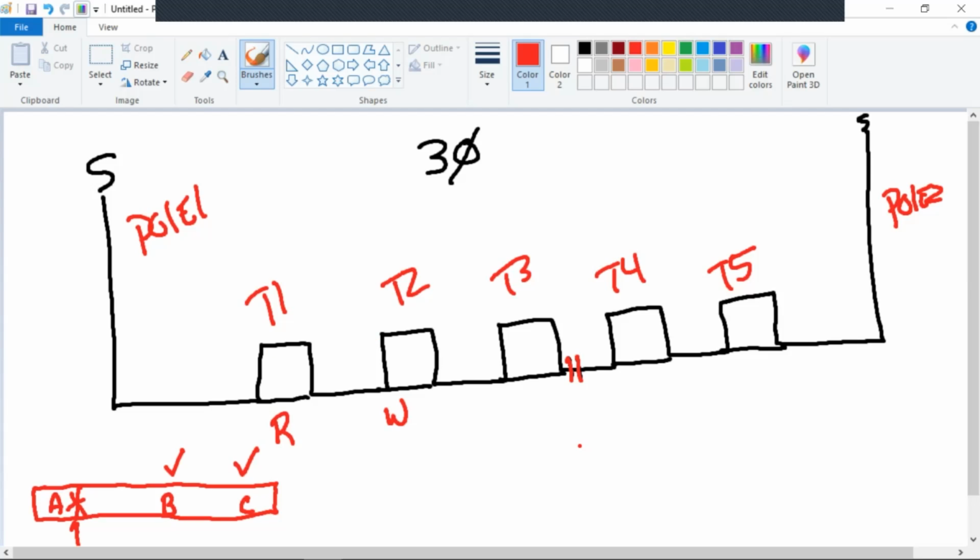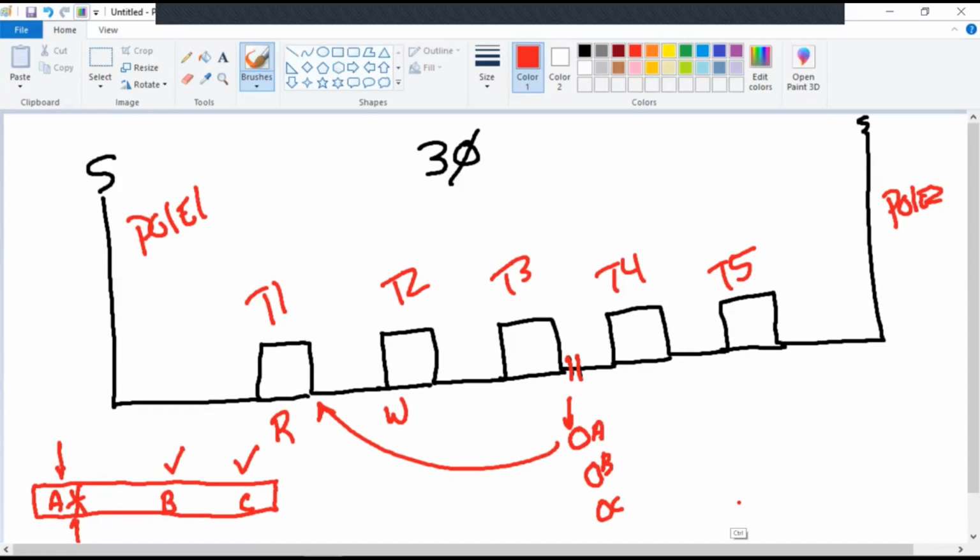Now, were you guys paying attention as far as fault indicators were concerned? If I have a single phase fault indicator, how many wires do I install it on? Single phase. One. If I have three phase, and I'll draw the A side of the transformer on three phase, how many fault indicators am I going to use? You put it on all three. Correct. So you're going to put it on A, B, and C. If the A phase fuse is blown here, you should have a red indication of T1 on A phase here. They should correspond. So, next part in the procedure. We've done the identify part.